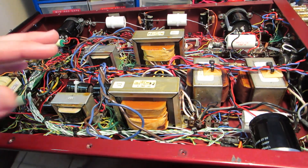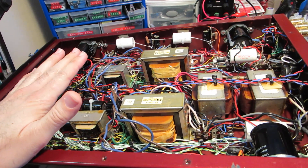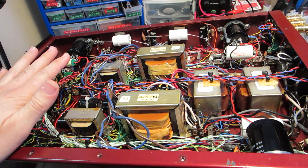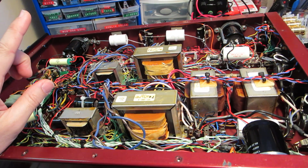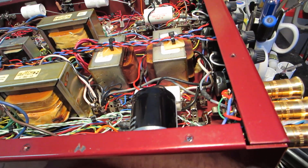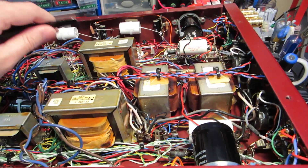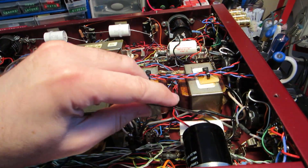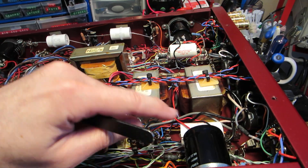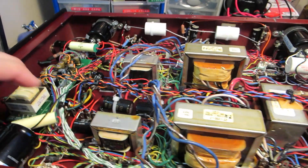In the course of going over it, it worked fine — there were no faults with this thing. But I found a lot of problems from factory, and I've already fixed a bunch of them. I've already gone through and replaced all the electrolytic capacitors, increased the capacitance — basically doubled it for the B-plus supply.